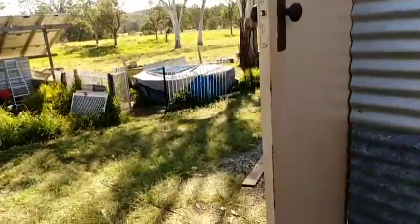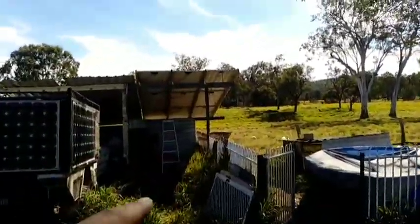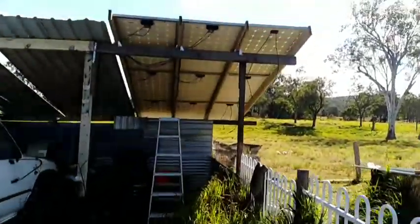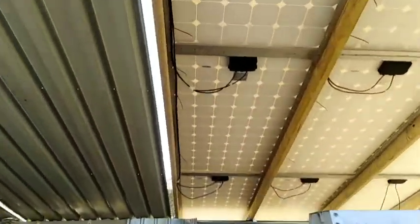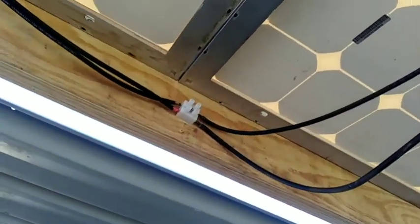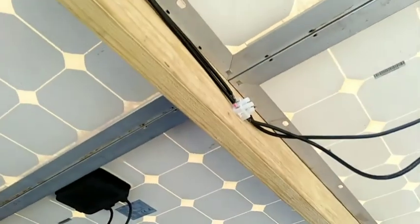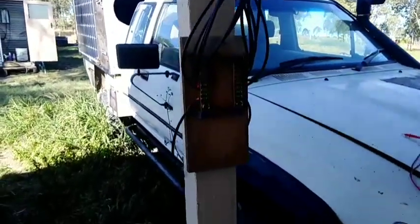So that's more or less how you do everything. Obviously I could show you everything done properly — cable on the ground going through conduit and being buried. I'm going to reinforce again: use proper wire connectors for solar. These little white screw connectors I've used work, but to do this properly you need to have sealed, solid connectors. That's the rough idea of how you do it — I might have another video in the future with everything done a bit more legit.